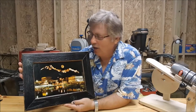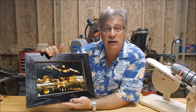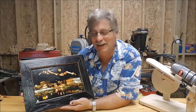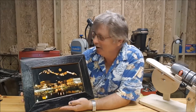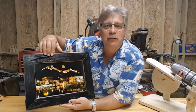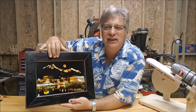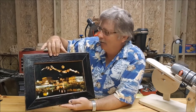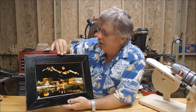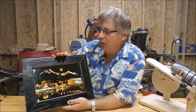Well, there you have it. What I loved about this project was that the torch gave it this nice dark color. Surprisingly, I didn't do any sanding at all. Like most of my videos I'd say here we go sanding, but this time we didn't do any whatsoever. When the torch flame hits that fine, slightly furry wood, it burns it right out and leaves a nice finish. And what it does is give you that deep grain look, as you can see.